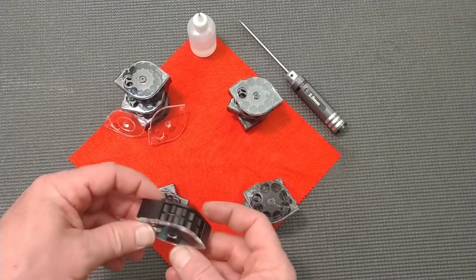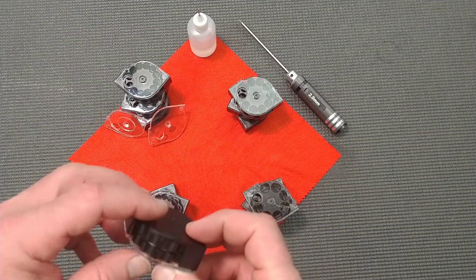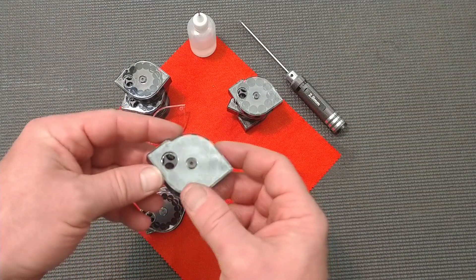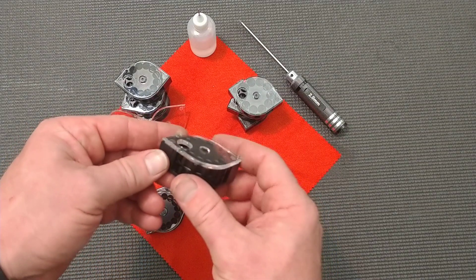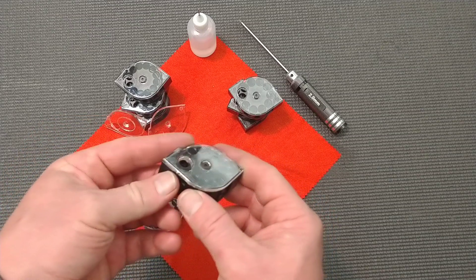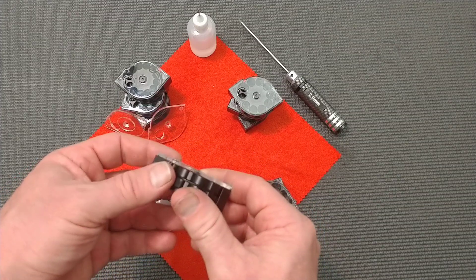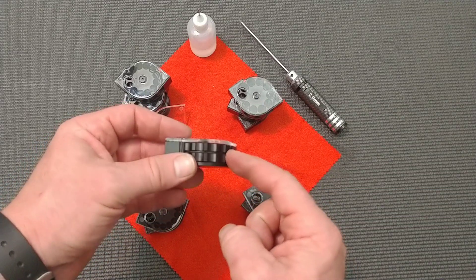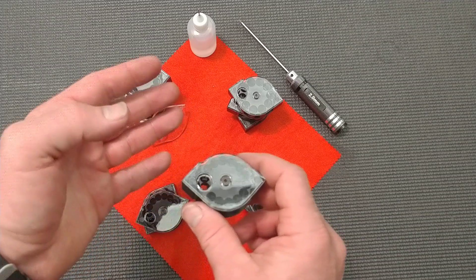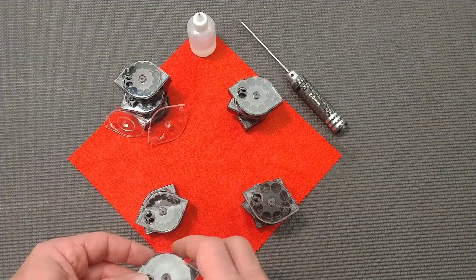The rest of the housing is aluminum billet, machined and black anodized. They now feature an O-ring to help hold the projectile. I elongated the internal machined feature on the housing — the pellet stop. I increased the length and put a nice chamfer on it, making it as long as I could without compromising the structure of the wheel, to provide the smoothest entry into the chamber as possible.